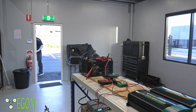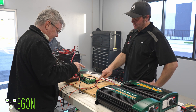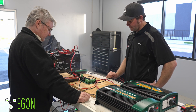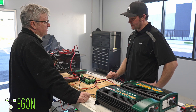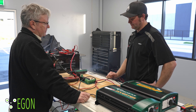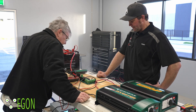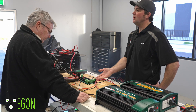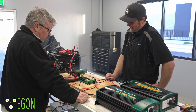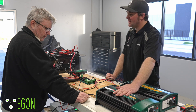That is the longest part — the longest possible part — and it is where the DC-DC chargers are connected, so that is where you want all that strength. It is over three times the rated current. We are putting 200 amps through it. I would not say that it is okay anymore — I think it is not soldering anymore. It is broken, but it is still going. We have not killed it yet. It is still working. This cable is hot, this cable is not very hot, so that is obviously pushing a bit more current.